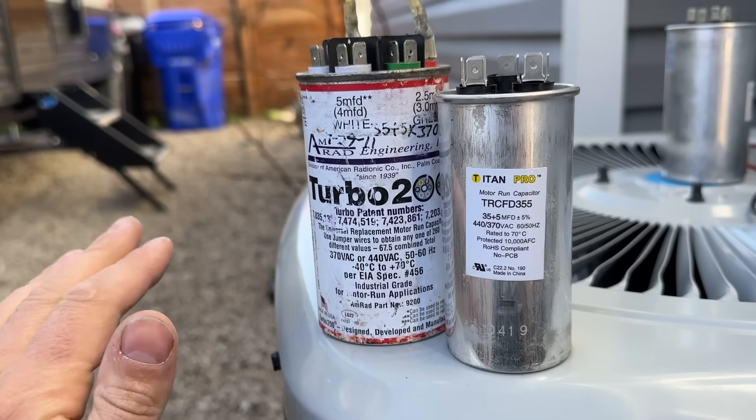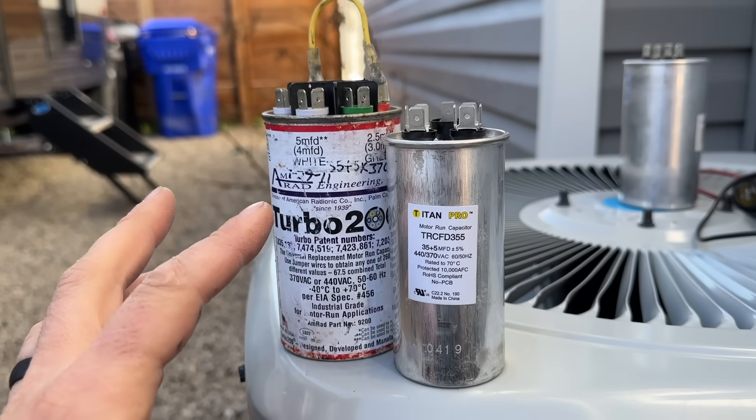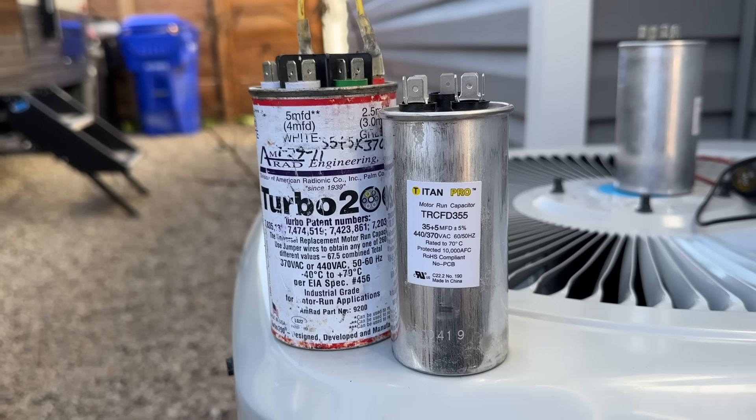When it's blazing hot outside, you don't have to call an HVAC technician to come out and charge you probably $300 to replace a $10 part — you can do it yourself and get your cooling back up and running quickly. I advise all homeowners to go ahead and pick up one of these capacitors, take the cover off your unit with the power off, see what the values are, order one on Amazon for about $10, and just keep it in your garage or junk drawer so you're prepared in the event that your AC unit quits working.